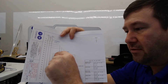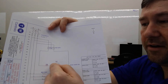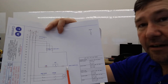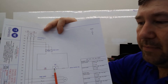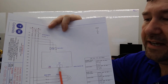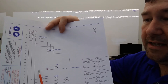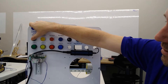So what happens is we're feeding 24 volt through our stop signal, and we're feeding it to both the start and to a contact on that relay. When we press the start button, it's going to make a path from our plus 24 volt to our coil and that'll energize it. What keeps it in so that you don't have to hold your finger on the start button is called a seal-in. Once this relay energizes, it's going to close that contact, allowing you to let off the start. And at that point, the only thing that can break the path of this relay is going to be the stop.